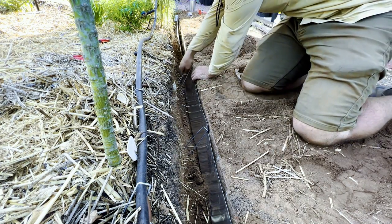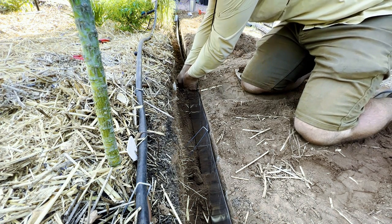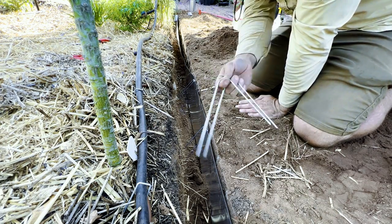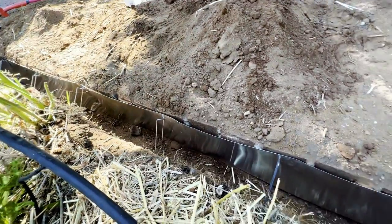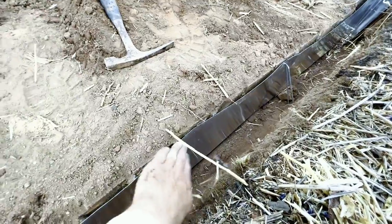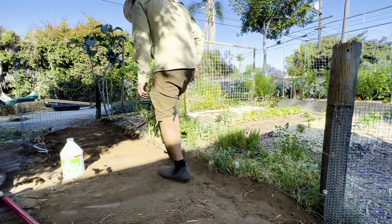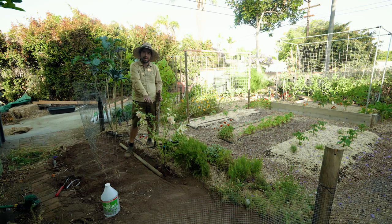The sidewall angle worked really well — trying to force it in and pin it right there. So now I'm going to put these last couple of staples and then backfill this. Here's a view from the other side — you can see the staples are all at an angle and they're pushing the flashing up against this brick line. Now we can go ahead and backfill this, and maybe we'll also talk a little bit about how to install a fence.